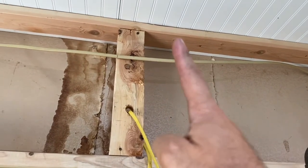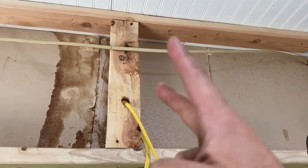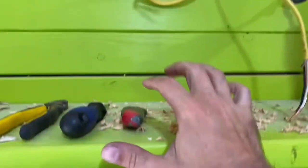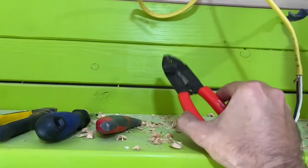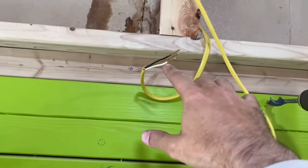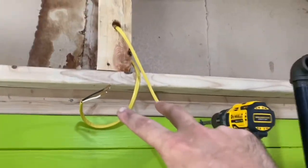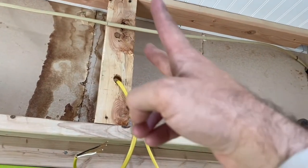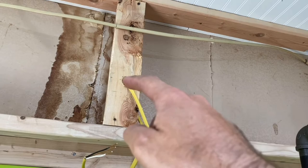I'm going to cut the wire right there — make sure you shut the power off before you start cutting. I'm going to snip this right here. I have a little stretch of wire I've used a box blade knife to cut back the yellow jacketing, then used wire cutters to get those ready to connect. I've done that on both ends and made it long enough to go out of my little fitting and up to where I'm making the cut. I also have a video on how to splice a wire if you're curious.